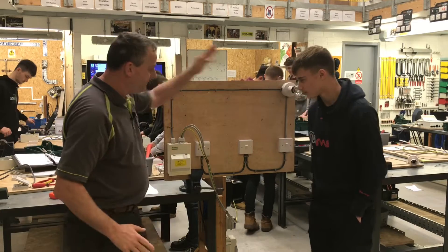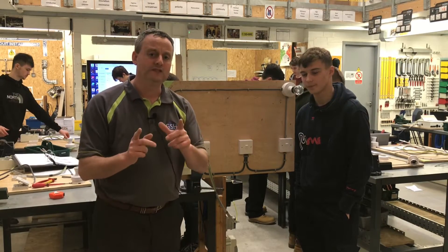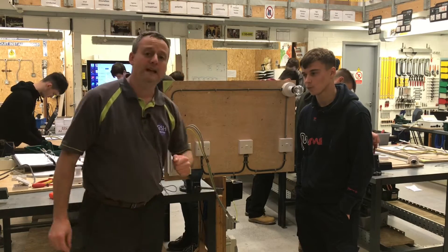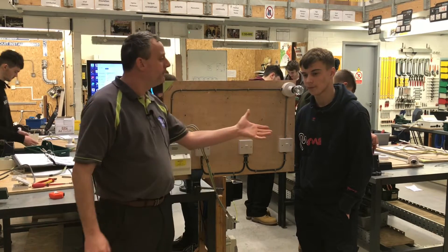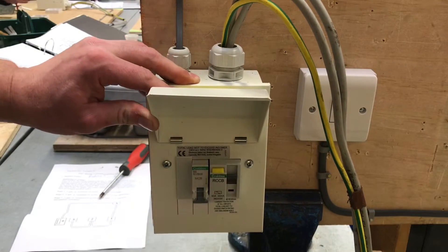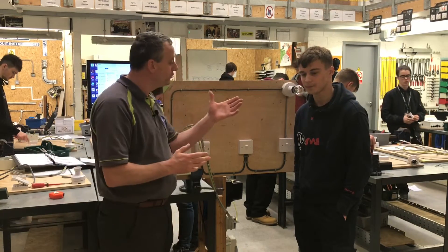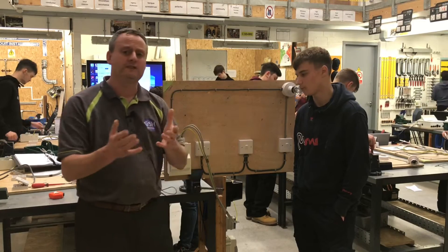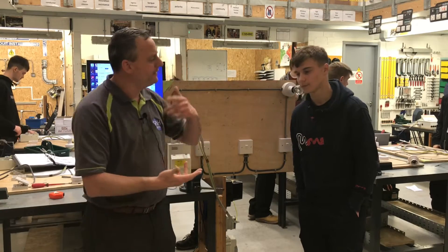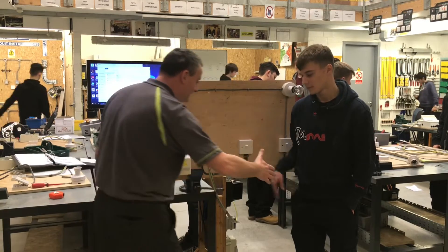You've been with us about eight weeks in the workshop. Gary's interested in whether you can answer the questions — people might say it's just quick-fire repeating answers, but we add layers of knowledge as we go. For example: what type of RCD is in this consumer unit? Type AC. Which does Gary prefer? Type A. We've had discussions about DC leaking into the line and neutral from charging units, LED lights, and where DC is relevant in a domestic installation. That information is going in as well.